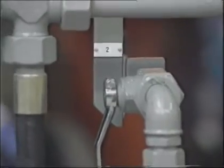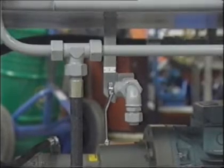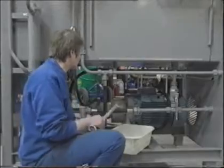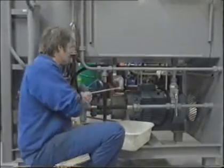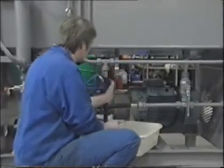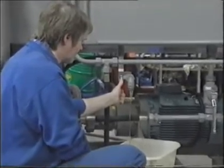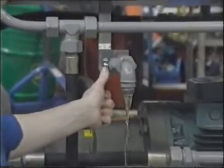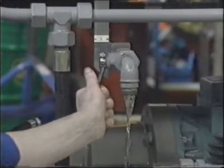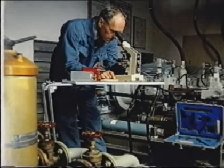Condensed water which collects at the bottom of the tank will soon destroy the properties of hydraulic oil. Water can be removed through valve 2. The same valve can be used to take samples of the operating oil. The first two litres which are tapped from the bottom are unsuitable for testing. The next oil must be collected in a suitable container. An oil sample must also be taken from valve 92. This should be sent to any reputable laboratory or other agency which, amongst other things, must carry out a particle count using ISO 4406. These oil analyses must be undertaken to ensure that the quality of the hydraulic oil has not deteriorated. If not, the oil must be changed once a year.